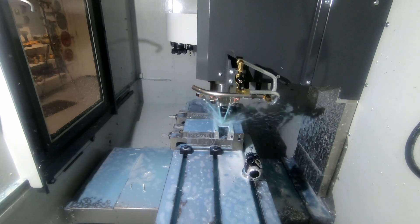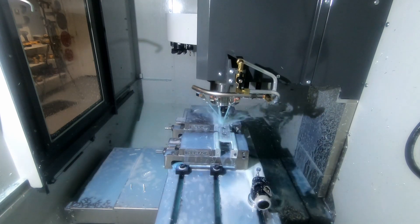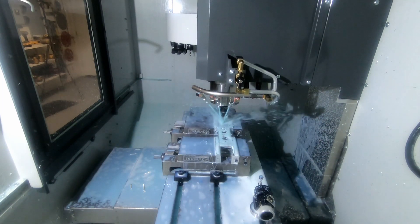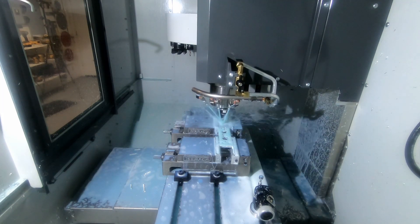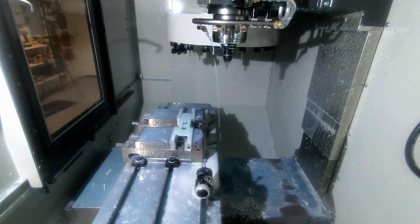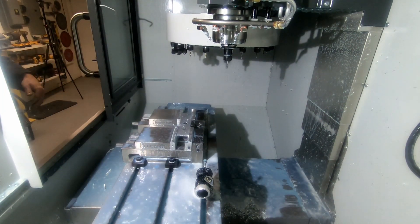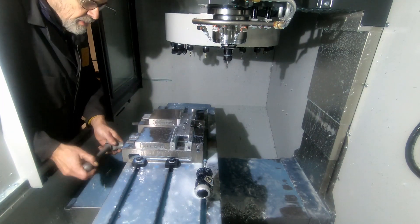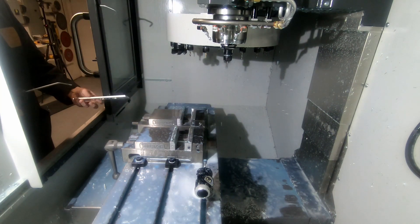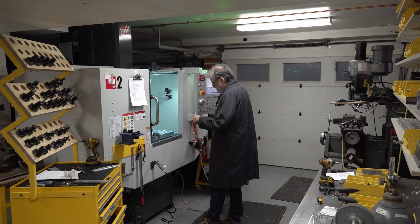And finally, rigid power tapping — the real thing. The Tormach could kind of get away with it using the compression-tension tapping head, but this machine does it right. It has the proper tool holder geometry that allows excellent flood coolant to be applied, and I don't need to do a pause to blow off the part and apply tap magic. The first operation just looks beautiful, I tell you. The software may annoy me, but this machine makes beautiful parts.